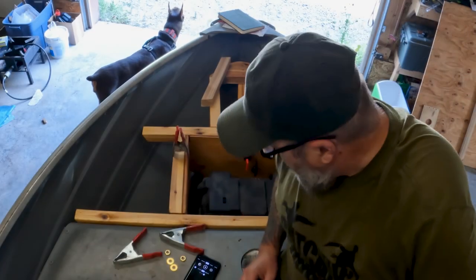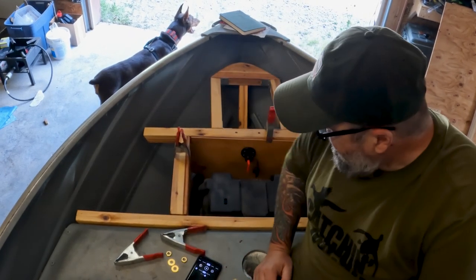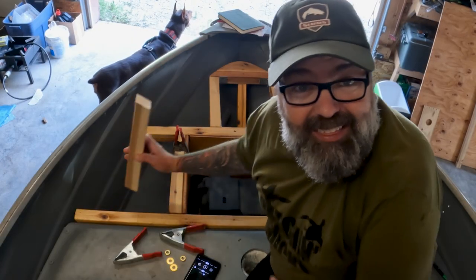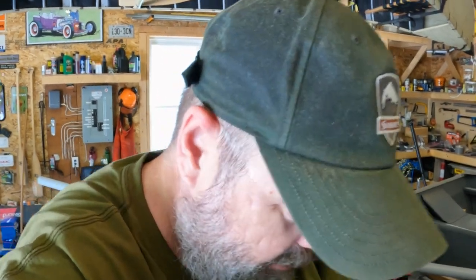So then the issue becomes, how do I add a little bit of extra support for this guy? Somehow maybe tie it in there. Wouldn't be a dumb idea. I think that's part of it. But I still think I need to get down here somehow. So the only thing I think that makes sense is if I go down the side on either side of the kill switch, sort of like a V, you know? Could have said diagonal. It's less words. And then maybe I do also add that extra bracket just across, just for a little bit of extra stability. Although I've got a pretty rigid plywood on top, so maybe I won't do that because I want to keep weight as a consideration as well.